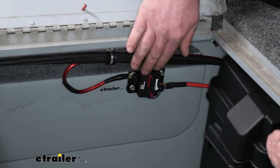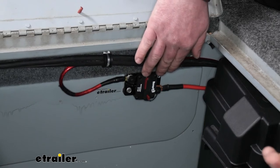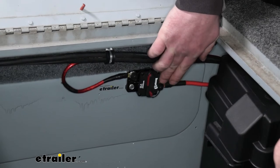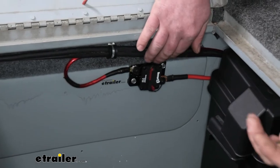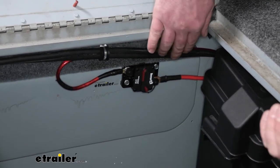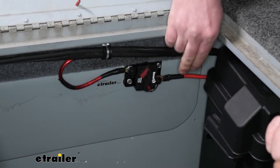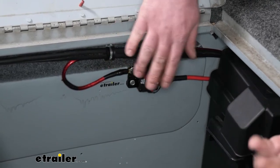Whether that be a snowplow, a winch, or in our case on a boat today — this is going to be used for lights, bilge pumps, things like that. How it works is when power runs through the circuit breaker from your battery, it goes out to that accessory. If you have a short or anything like that, that would draw excessive current — any current past the amount the circuit breaker is rated for, the circuit is going to open up. The breaker would trip, cutting power to that accessory so you won't risk damaging it.